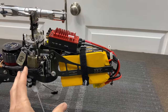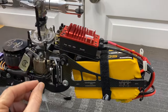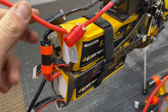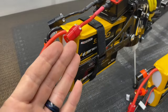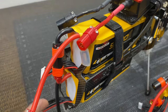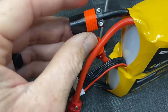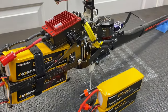We got all of our RC Pro S7 connectors soldered up. Our series connection lead is really short and then we have our positive and negative. I like to make sure all my wires are the same length so you don't have a shorter run than others — negative going here, positive going here. The second set of batteries is done the exact same way. Short with the orange bands is the series connection, long is your main connection.